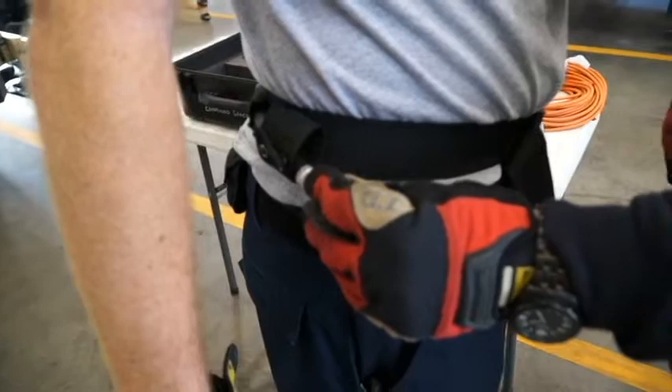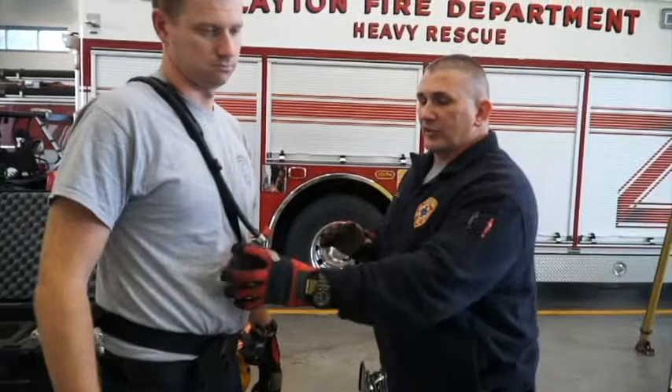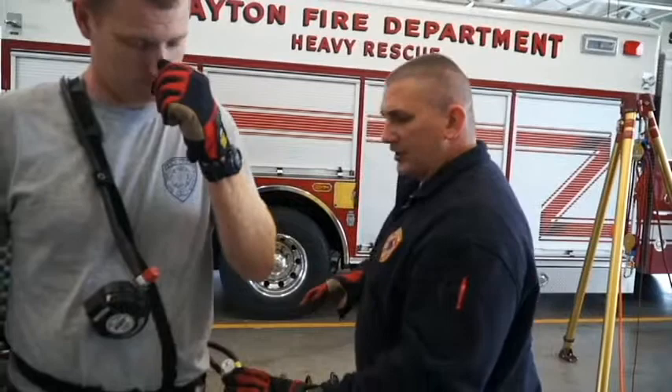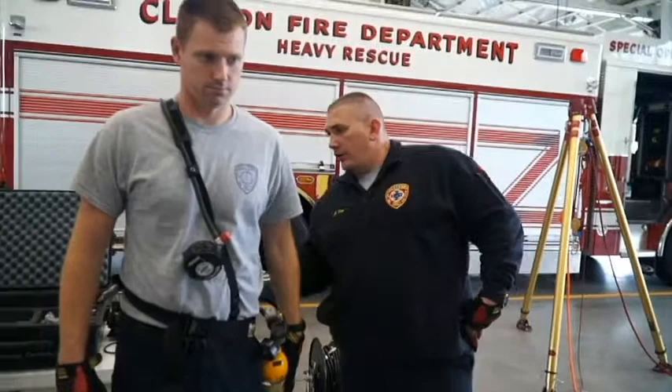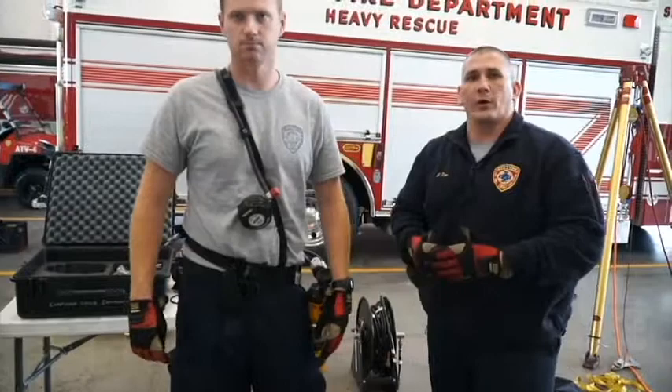The airline itself hooks into the waist, providing air to the rescuer. One unique difference from firefighter classes: in firefighting, the regulator comes off the left shoulder, but here the regulator comes over the right shoulder. What is on the left side is the escape bottle. The simplest way to put this on is to put the bottle on the left side, throw the regulator piece over the back and right shoulder, clip it back into the waistband, and buckle at the waist.